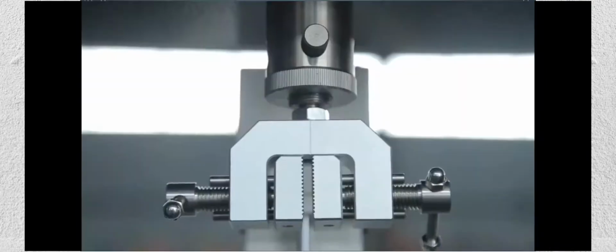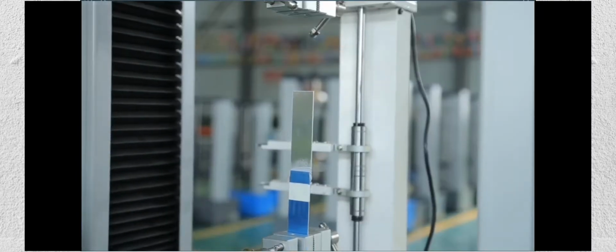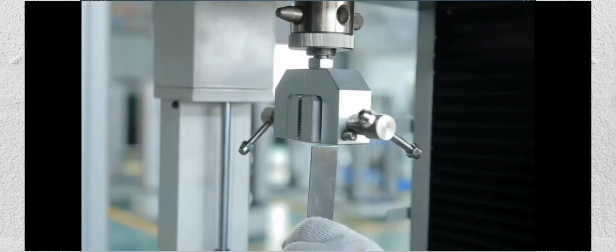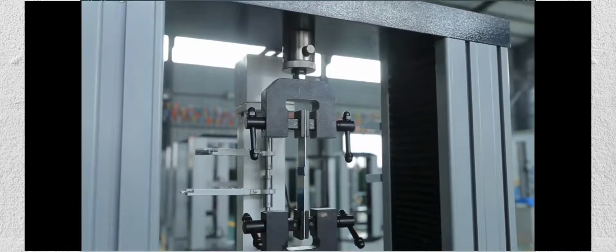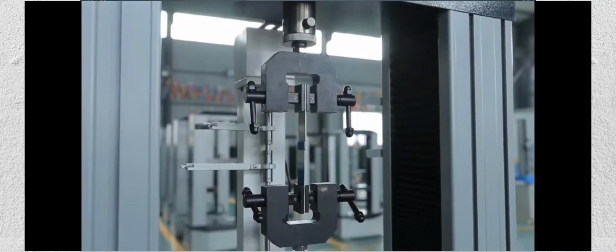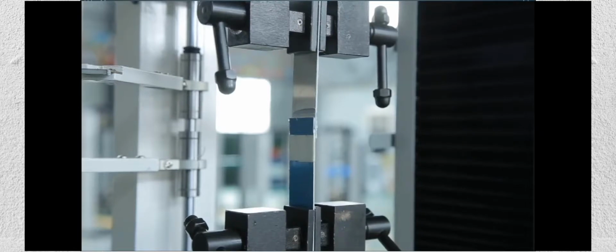The bond strength test is performed with a UTM machine to check the adhesive force between the two layers of any material. The final result for the bond test is measured in the form of average force. Here the graph is checked at the end of the test. If the graph gives out uniform force, then it is concluded that adhesive is properly applied to the test material structure, and if any peaks or troughs are observed in the graph, then it is concluded that the adhesive has not been applied uniformly to the test material.